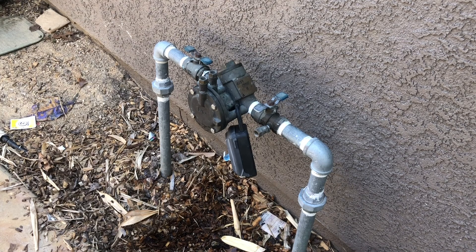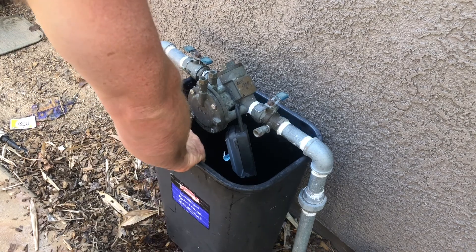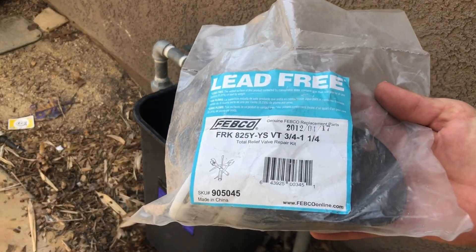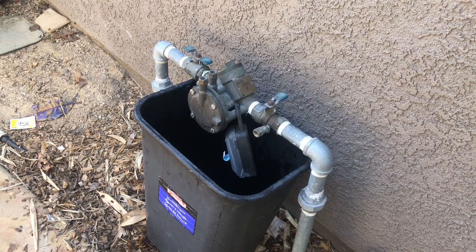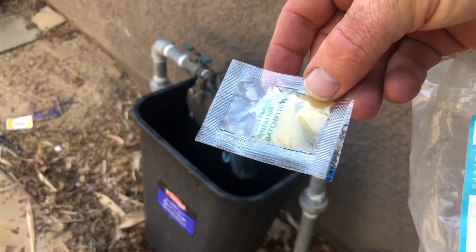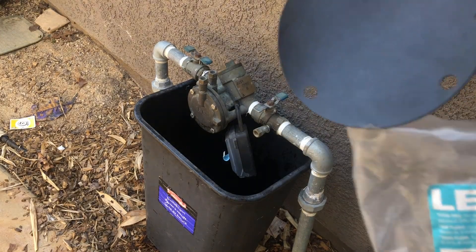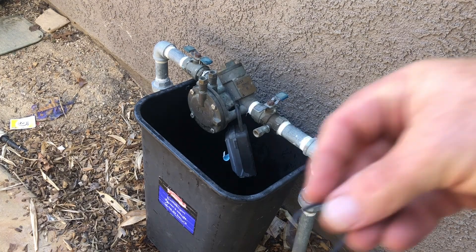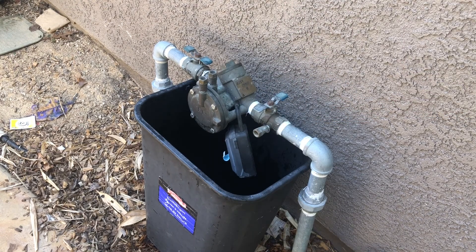While I was waiting for these parts to come in the mail — about four days — I ended up putting it all back together and it still leaked the same. However, I would leave the valves turned off when I was not running my sprinkler system, and then I would turn these valves on when I was running the sprinklers. Of course it would leak when the sprinklers ran and fill up a trash can a little bit, but it really wasn't a big deal. For me it was a pretty slow drip — it would fill the trash can in like two hours. I'm showing you the kit I ended up buying online; there's the new piece, it comes with a little bit of lubricant and also the diaphragm.